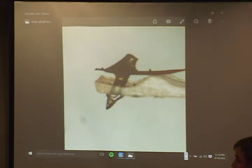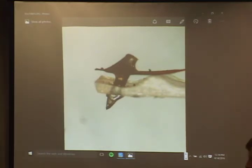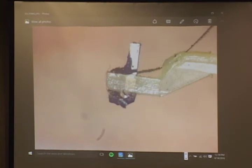That's what a clean stylus should look like, and your player has a stylus cleaner on it. In most cases, it'll get rid of that, reduce that next time you put a disc in. Next question. This is what it shouldn't look like. That black deposit tells me it's picked up some plastic from the disc surface. It could be an old disc, or one that someone's washed with a detergent, for instance. That means it's got no lubricant on it. So you get a chisel, actually. That stylus didn't play until we cleaned it.